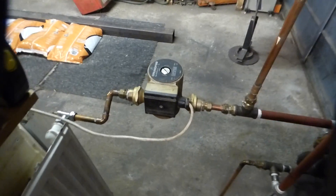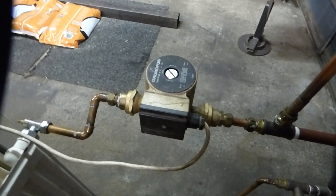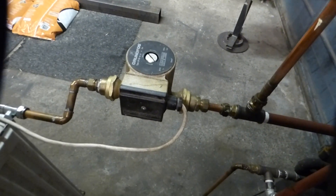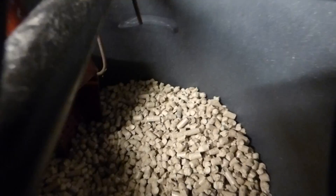This is all for the people that don't understand much about heating. The pump is not the right pump — that is a domestic hot water pump, all made of stainless steel. It's one I had kicking around in the workshop for years. It's not a very high flow rate, which is perfect for this because there's only two rads, but there will be more radiators later and I've got to get around to making some.